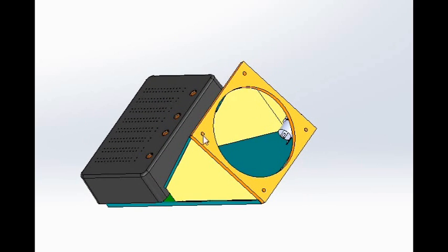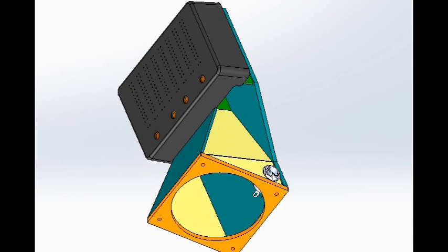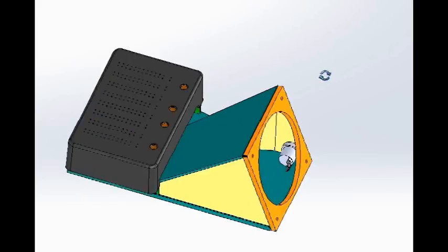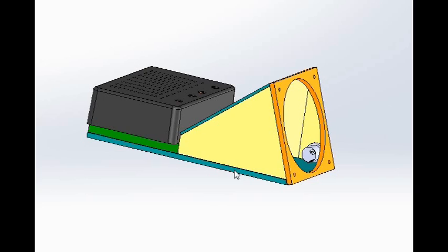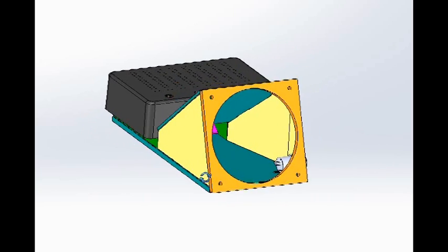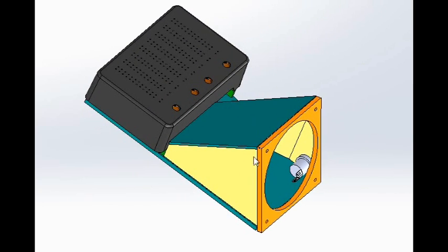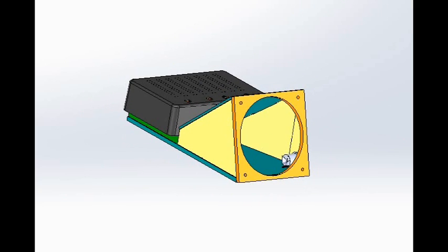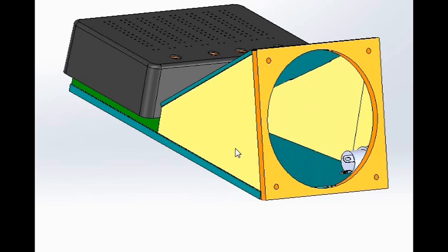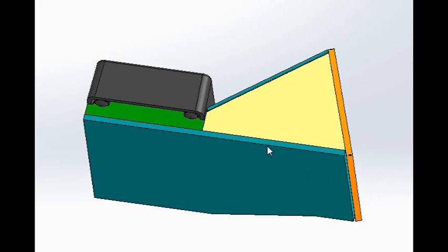The fan — these holes are tapped for the fan. We have a jack for our 12-volt supply. I decided to make this out of 1/16th and 1/8th ABS. The 1/8th is for a sturdier bottom for everything to mount to, and the fan is also 1/8th material, then the rest of it is 1/16th. This was probably the easiest way to make this that would be reasonably easy to produce in the small numbers that I'm going to be making them in.